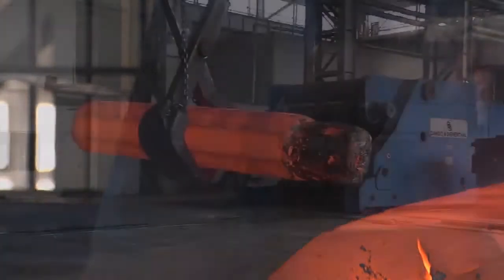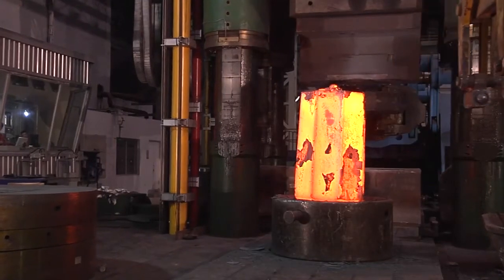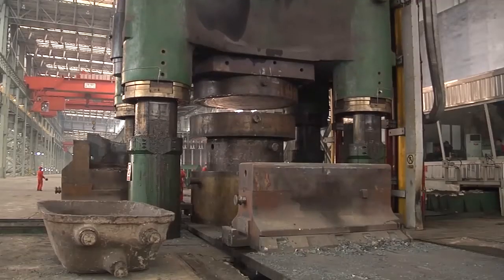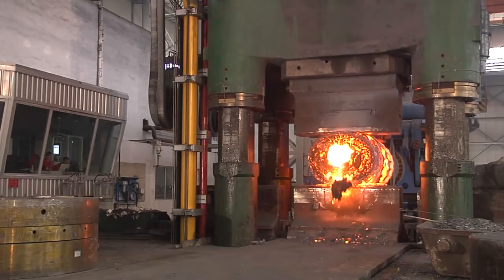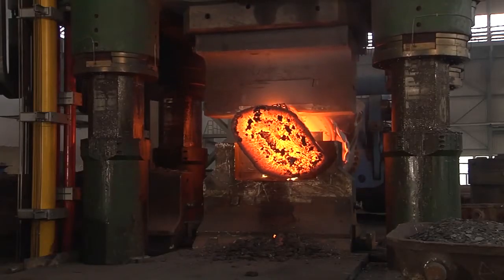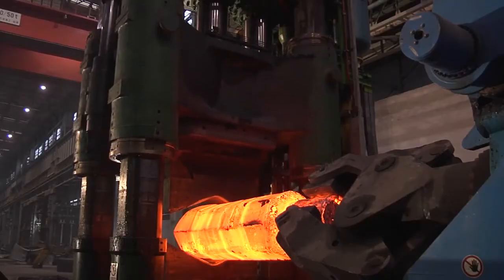The finished forging is transported away. For quick retooling, the forging plant has, among other things, a die slide for three dies, a table shifting device, and an upper clamping and turning device for quick tool changing. A polygonal ingot weighing around 70 tons is formed. Here again, forming takes place by stretch-forging the gripping neck, then upsetting, and finally stretch-forging to form the octagon.